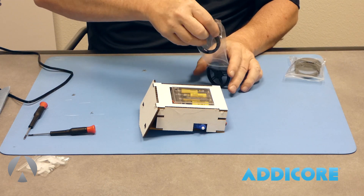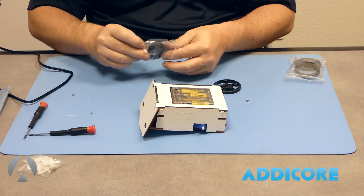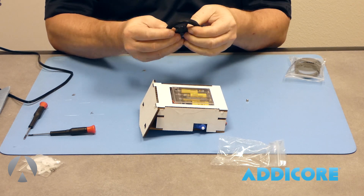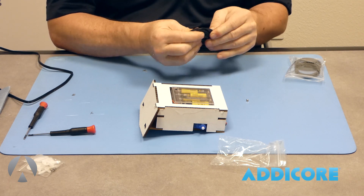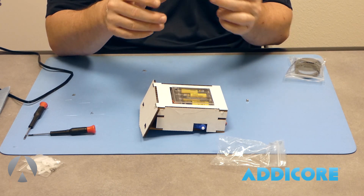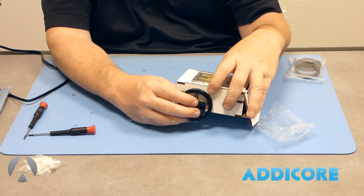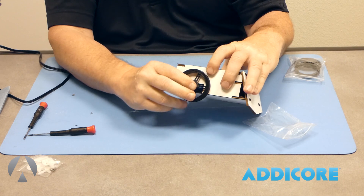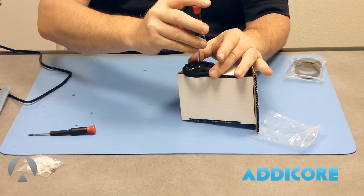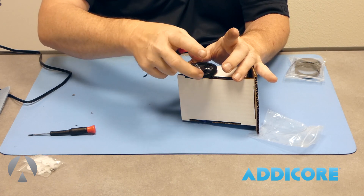Next step is to take the wheels out of the bag — make sure you don't lose the little screw. If you miss one, there are extras in the bags from the servos. You have a plastic wheel and a rubber tire; just roll the rubber tire onto the outside of the wheel to pop it on. On the wheel there's a flat spot and a bigger hole — the bigger hole goes onto the servo. Press it down nice and tight, then take your Phillips screwdriver and screw it down in the middle hole. Roll the wheel to make sure it's not wobbling badly.